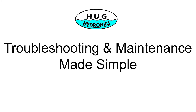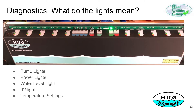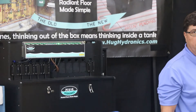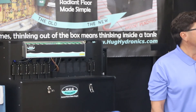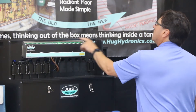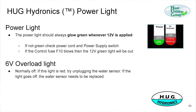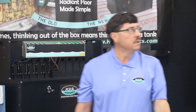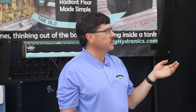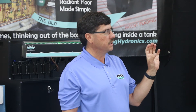Troubleshoot and maintenance: there's a bunch of diagnostic lights on the top — each pump has a light and each thermostat has a light — and we'll walk through that. There's also a water level sensor and a water level light on the unit. The power light is here; it illuminates when there's power and should typically be on. If there's something wrong with your power supply, check to make sure the power light is coming on. There's also a 6-volt overload light — if it's out or unplugged, it likely means you have a bad water level sensor.